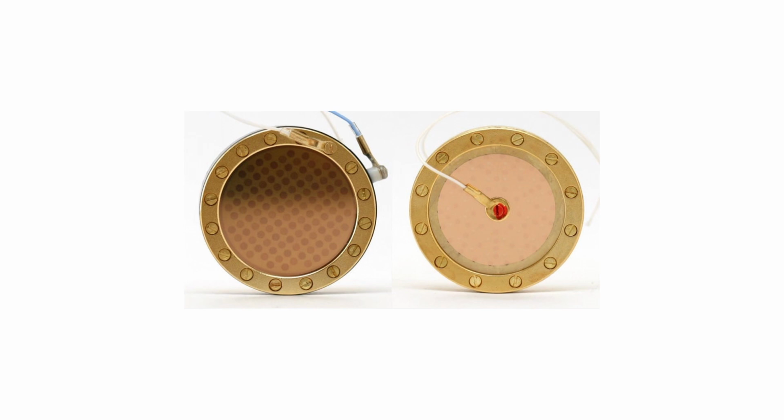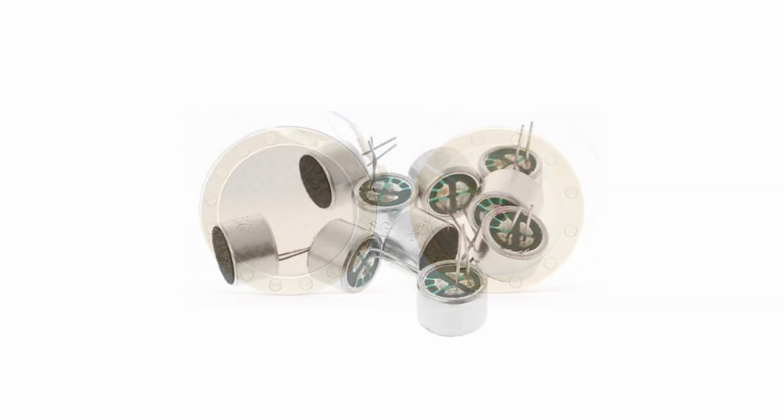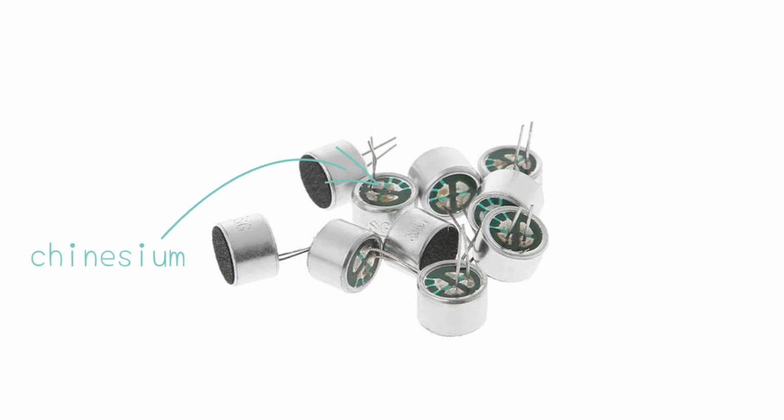For a condenser mic to work, it needs to be charged. Large diaphragm capsules need up to 200 volts for charging. The material used to make electret capsules allows them to be pre-charged and stay charged without an external source of electricity. What I needed was a microphone small enough to mount in the wall, which is about 6 mm thick. Perfect for this job is an electret capsule, the same as used in cheap Chinese condenser microphones.